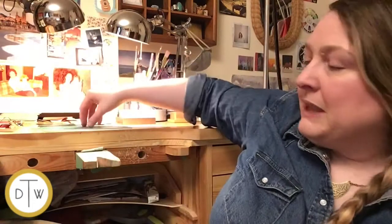In terms of blades, this is the blade that I'll be using today. This is a number 2/0 blade, which is good for cutting metal of about 1 millimeter thick or a little less than 1 millimeter thick. I've placed a link to a chart below in the description so that you can see what the ideal number blade is for the thickness of metal that you will be cutting. This is what we tend to use for all of the cutting at our shop.